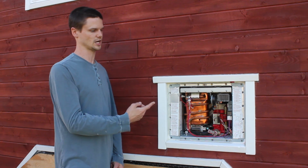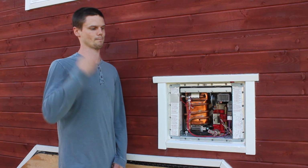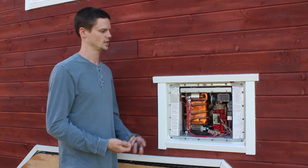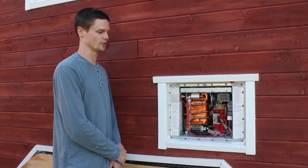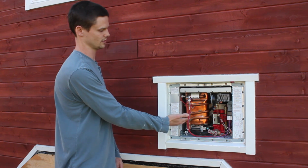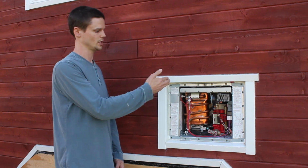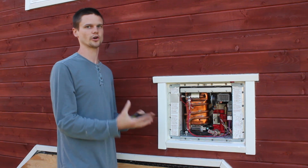We've basically got this garden hose hooked up, and we were just turning the valve full blast for testing purposes. So there's a massive amount of flow, way more than is going to be when we have a shower head or even the faucets and stuff. We won't be blasting the full force of a garden hose out of those fixtures. And so it's simple physics in terms of that. There's a set amount of heat that the flame is pumping out, and if we're pumping lots of water through, it's going to get that amount of heat. But if we pump less water through, it's going to get that same amount of heat. So less water, same amount of heat means hotter water, basically.